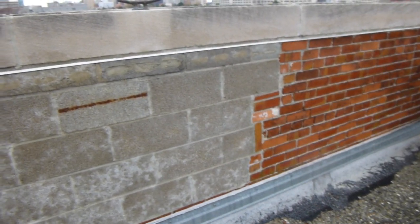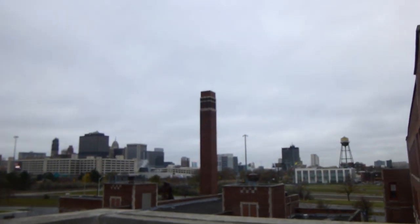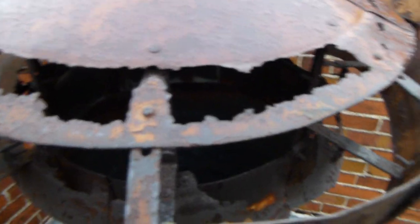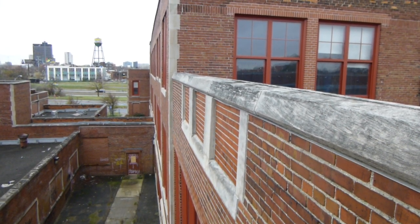It's a really obvious one — they did it with cinder block here. One issue I want to point out is all these stacks. Some of these are air shafts and some of them are chimneys, like over there for the furnace or whatever, and these are rusted out pretty badly. I think they'll all probably need to be replaced. But the parapet wall, which as I said is typically a disaster on these old buildings, is really in pretty darn good shape on this building so far.